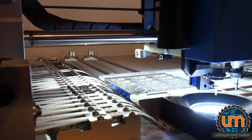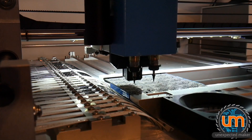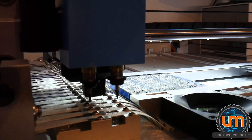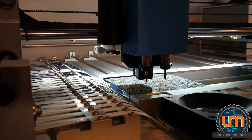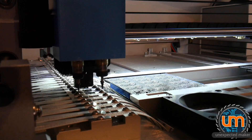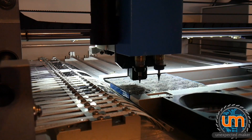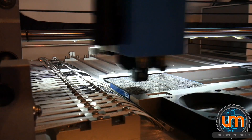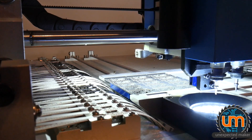It generally only needs this double pick-up like that on the first board of every run if the tape was uneven because of an uneven pull from the previous one, that's all. That's why I get to watch it and make sure that it actually does pick it up and re-fix itself. The advantages of using machine vision — you can detect that it didn't pick up the MOSFET just then, and that time it did.